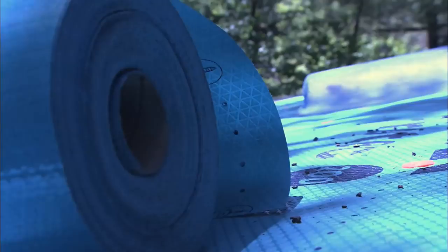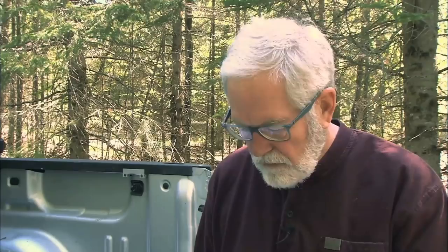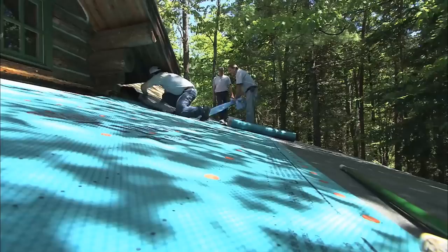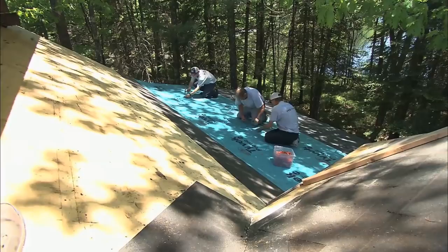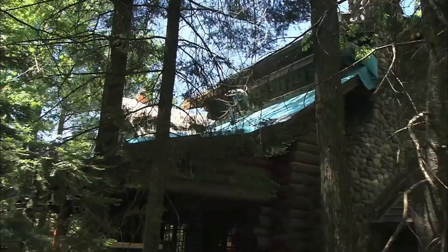This is a four-layer system. On the back there's a grip for the deck. On the top there's an embossed pattern for walkability, and in between you have two layers — one scrim for strength and a water resistive barrier. There's no adhesive on the back, which makes it easy to reposition. The unique texture on the backside grips the deck when weight is added. Those elevated triangles provide walkability, with channels to direct water and reduce the chances of slipping — important on an 8/12 pitch. We picked this because the roof material going up will last a good 50 years, and that's why we're using the Tyvek Protec 200 — a more durable product with a 50-year warranty.